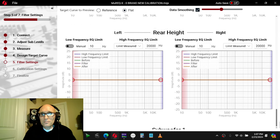So with this gain of 7.4, a Q of 0.9, at 82 hertz, we're at 0.1. That's nothing. And I'm reaching my full peak here, 7.4 at 30. So yeah, that's what I've decided on. And the frequency, yeah, 50, because it allows this to happen and keep it within that range where I want to be. This is a low shelf filter, and essentially this is just now applying the target curve to both of these subs.